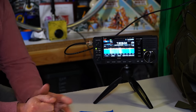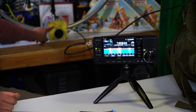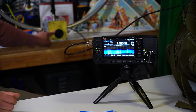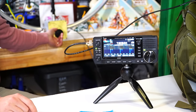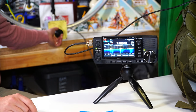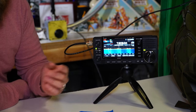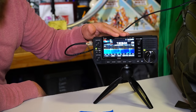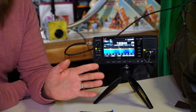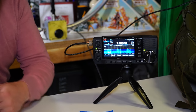Now, just to give you a bit of a demonstration on how this works, I have the antenna switched on the A bank, which allows it to go all the way down to 80 meters and up to the higher side of 40 meters. And if I just turn the knob here, watch the 705. The signals are gone. In fact, that's exactly how you tune a loop like this. You just turn the capacitor until the noise comes back. And I'm in a very noisy environment, so the noise is pretty prominent, but it gives you a really good understanding of how loops work. You adjust the tuning knob of the capacitor until you get maximum noise, and then you use something like an SWR meter built into a radio to tell you where your SWR is at. And if you're not where you want to be, you just simply go in and give it a little nudge either way to fine-tune it some more. And that's kind of how loops work.